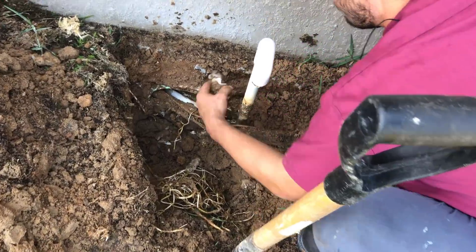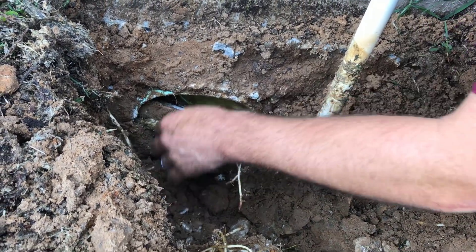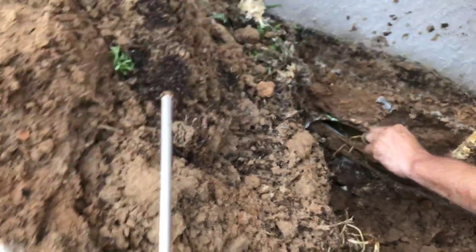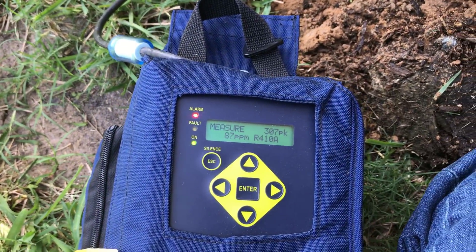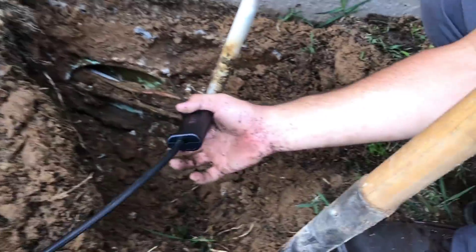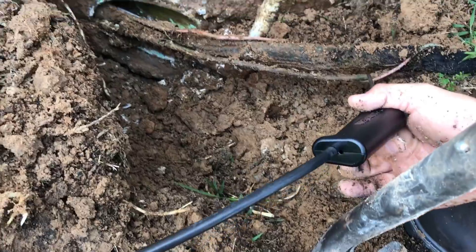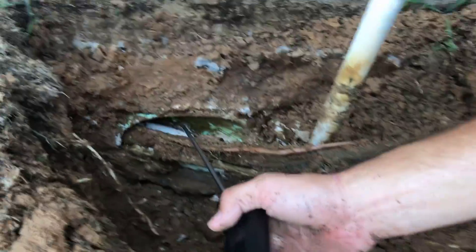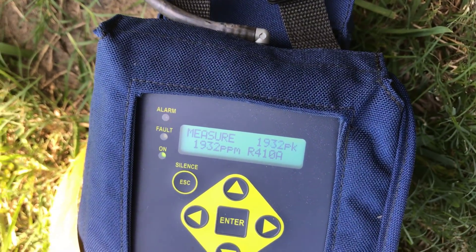Jesse has dug us a pit and exposed the chase. The chase doesn't seem to be sealed at all — looks like they just threw some mastic on here. Interestingly, inside it's really well sealed, but out here you've got nothing. That's the chase coming in at a 45-degree angle. As we get closer to this opening, we're already at six, seven parts per million of R-410A. We're not even in the chase and we're reading — whoa — 1,000 parts per million. At this point, all we're going to do is check the copper that's above the ground with soap bubbles. You can see we've got significant ambient refrigerant inside that chase.